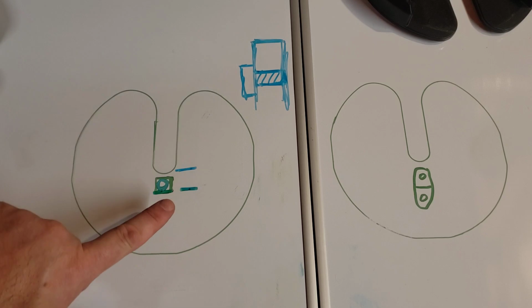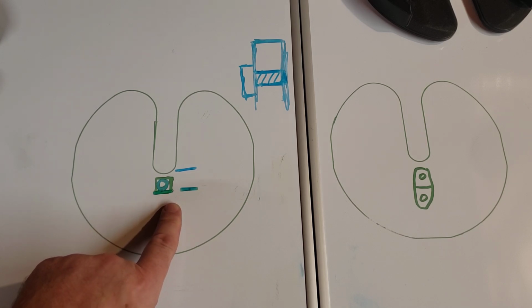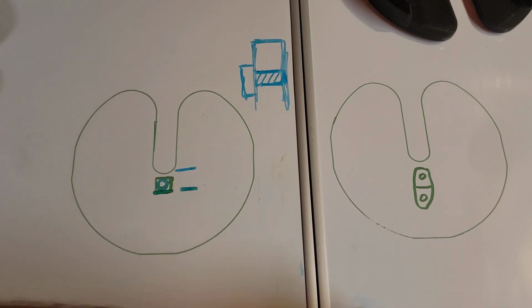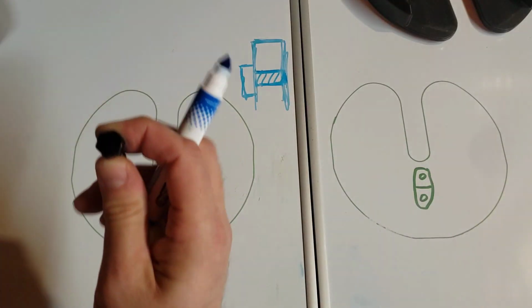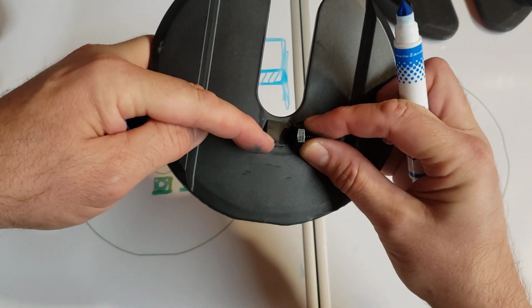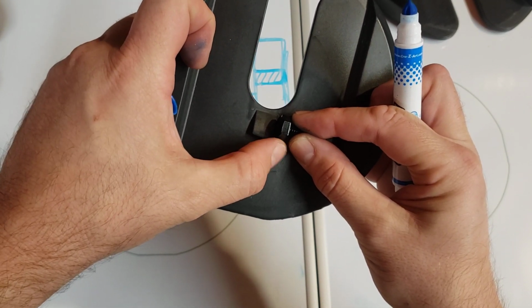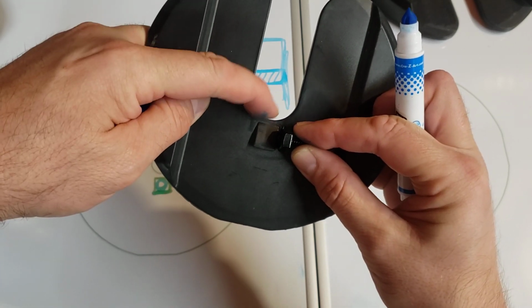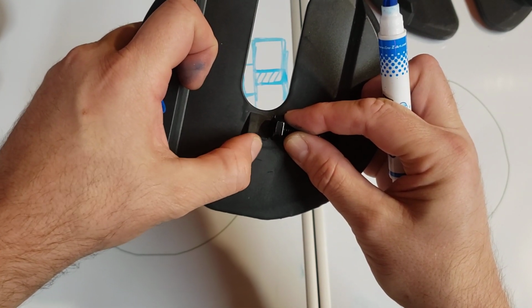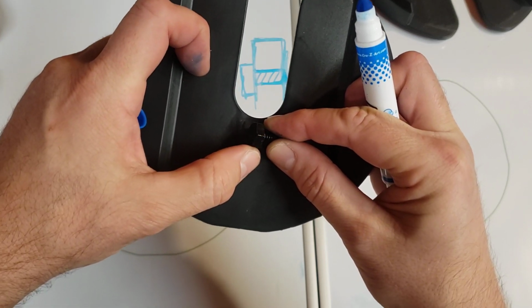very important. That distance on your set, and I should have taken the measurement before doing the video. The distance here is very important, meaning that the head of your bolt should be at the same height from here to here as the bottom of this tab. Okay, so this here and this here, same distance from here. So you have to tap the hole here in order to make sure that this from here to here is the same as from here to the bottom of your bolt.